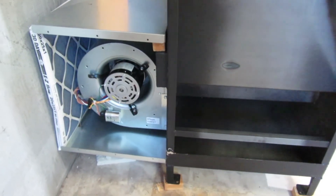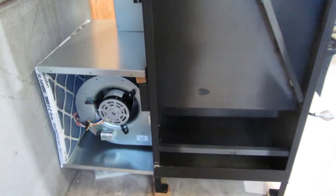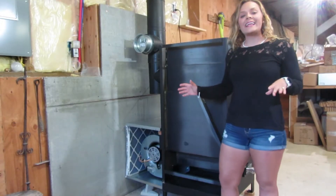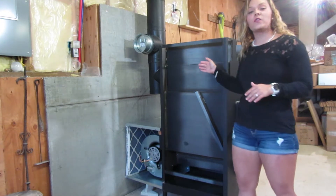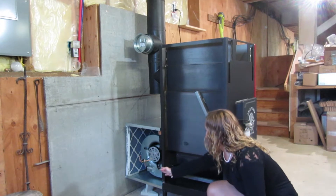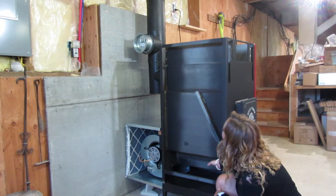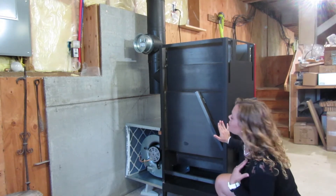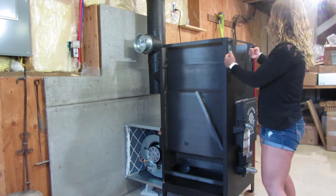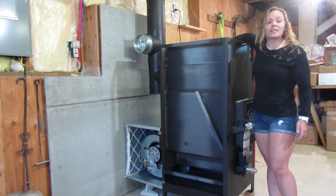The furnace blower is located on the rear of the unit and the filter box does attach to the rear of the blower. I have the side insulated panel removed so I can show you the construction of this unit and how the heat flow works. The blower is located here on the rear — the blower pushes the heat below. Once the side panel is attached, this is essentially under pressure, so the air will naturally rise up through the front and into the top of the furnace here. This is where the plenum will attach.